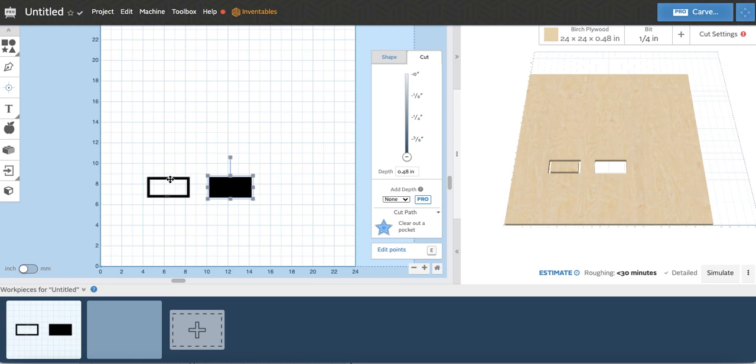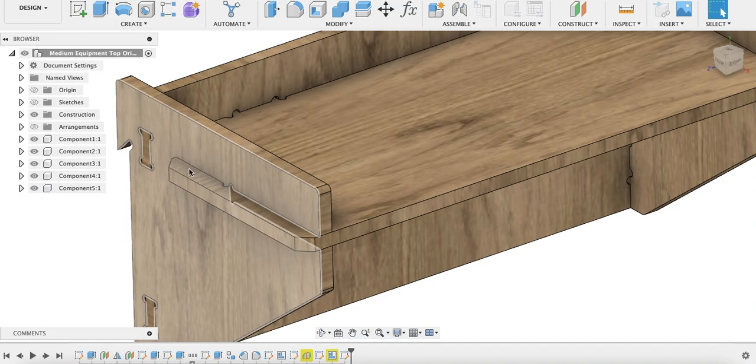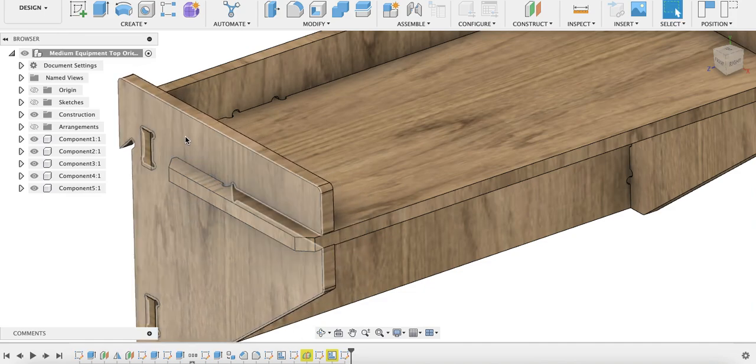So remember, I said that this was 4 inch by 2 inch, but when I actually measure how big that hole is, I might get a size of, say, 3.98 by 1.98. So basically 0.02 inches too small in both directions. So you can see how this would be a problem. If I go back to this screen, this would be a problem for friction fit, in that you'll want to account for this size so that you account for this machine error and get the proper fit.